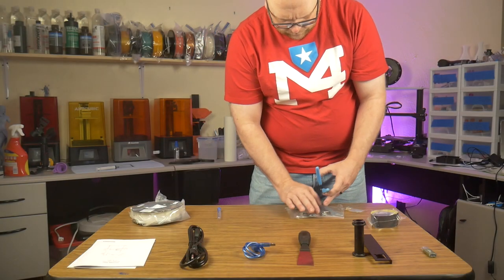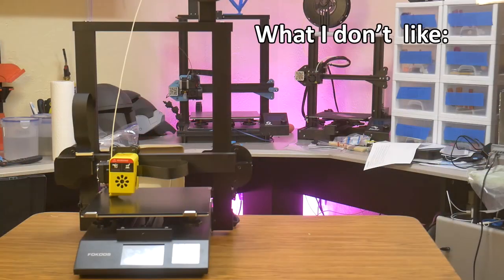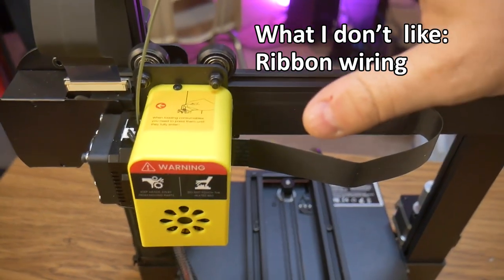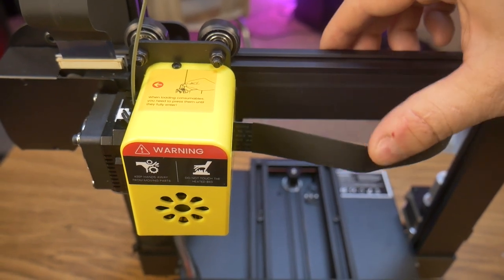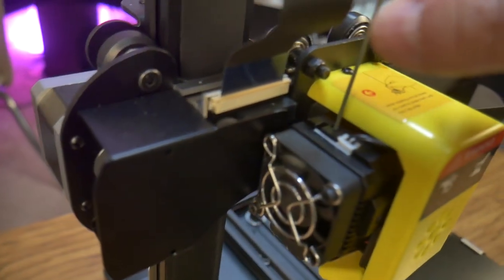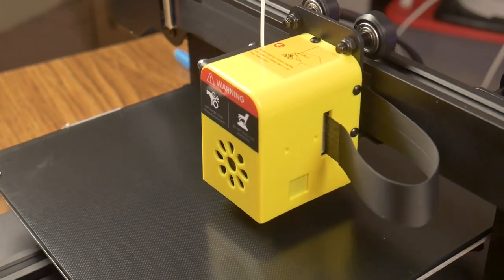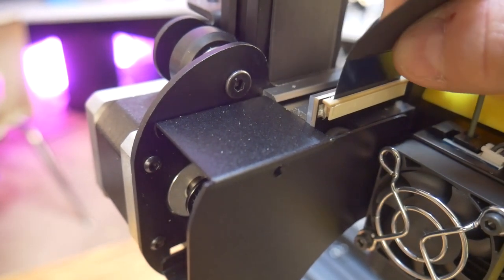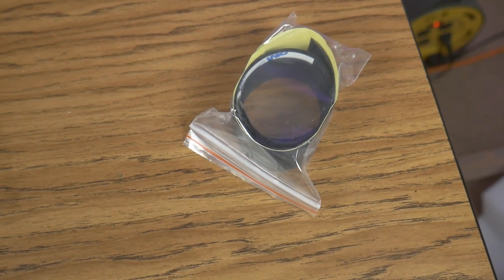The Focus Odin 5 comes with everything you need to start printing all in one box. Here is what I don't like about the Focus Odin 5. Ribbon wiring — this is a trend I'm seeing in many printers, and is not confined to the Odin 5. On one hand, the ribbon cables tidy up the wiring a lot and eliminate the need for cable chains or other wire support. But my instinct tells me these ribbon cables aren't designed for the repetitive back and forth movement of a 3D printer, nor are the circuit board connectors designed for the stress of those movements. Focus providing spare cables in this kit might be an indicator that there will be problems in the future.